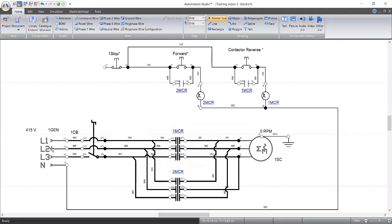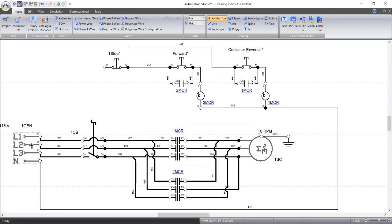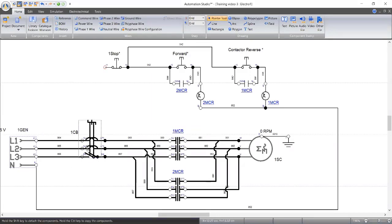So what about just putting something that will not allow you to start at all? I think that's our best bet. Not until you press that stop, it won't allow you to start. I think that one is okay. It's still much better, because we won't need to buy another contactor or relay to do our switching. Because normally, if you remember this circuit, what's it called? Star-delta, which we'll still get to.